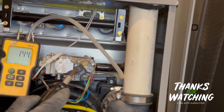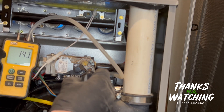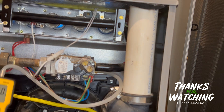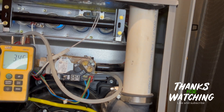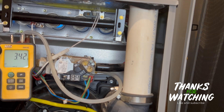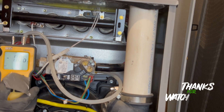We don't need to be extremely accurate with a simple appliance like this, but as close as you can get will suffice. Then we will check the pressure in high fire. Either manually jump the unit into high fire by jumping W1 to W2, or wait for the thermostat or timing on the control board to initiate high fire. We are looking for about 3.5 inches water column on this particular appliance. Always check your rating plate as equipment can differ. Once you are all set, turn the appliance off.